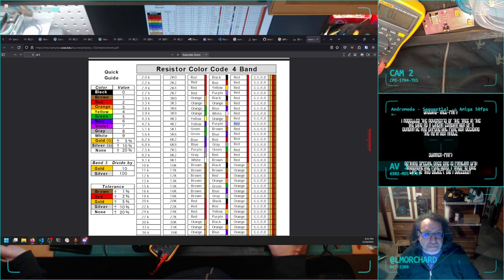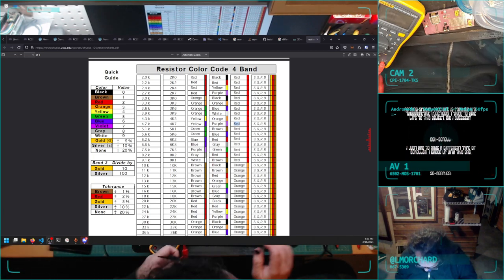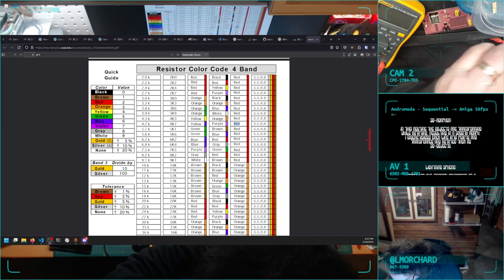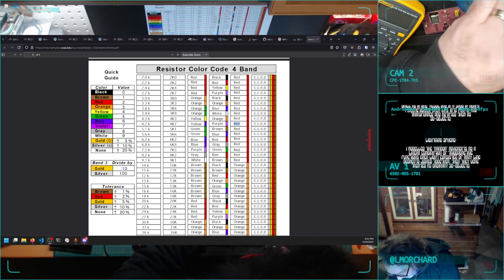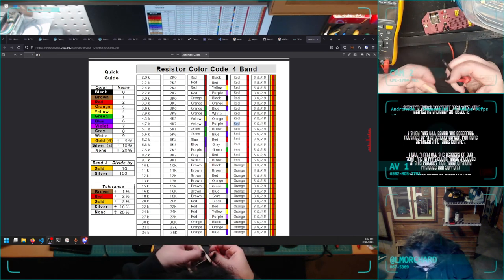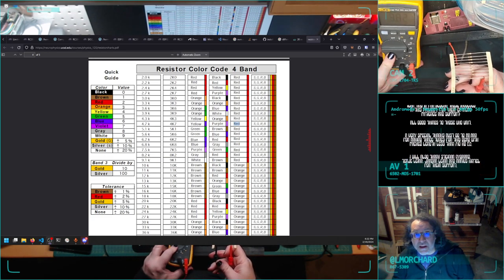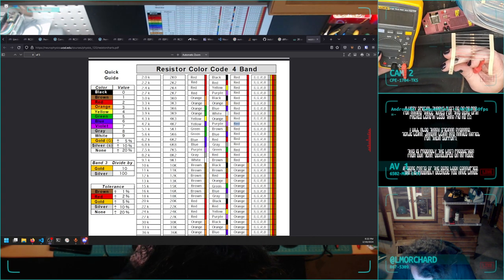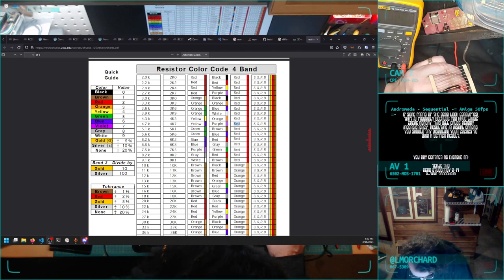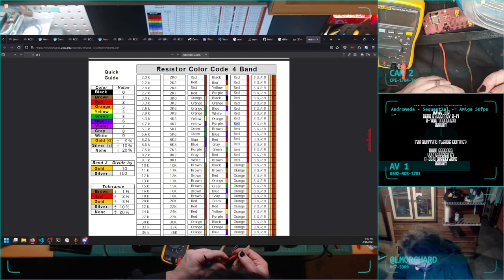Oh boy. Okay. Yeah, I gotta run into the house for dinner soon. It'd be nice if I could get these resistors in here and then button the thing up. That's 3.2. This 8K, that doesn't seem right. 9.8K, okay. I call this 9.8K, which seems pretty close to 10K. Yeah, I measured this at 9.8K, which the bands are brown, black, orange, gold. Okay, that counts as 10K. All right, fine.